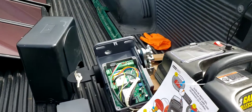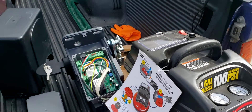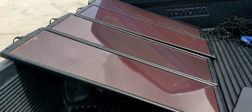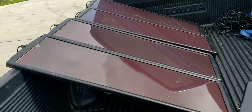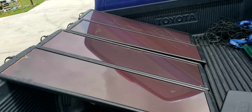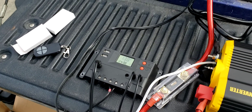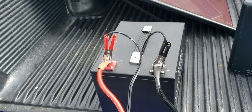So I got something that was equivalent in power: this 100 psi air compressor. What I got here was I bought this solar panel kit at Harbor Freight for $189. It came with four solar panels, putting out 50 watts per panel — that's 200 watts at 12 volts total. You also got this little controller. The controllers are very important because they basically control the amount of voltage coming in from the panels going to the battery to charge it.